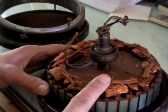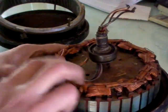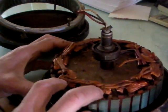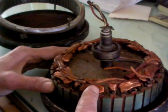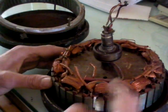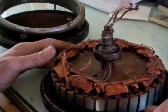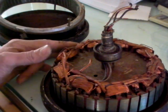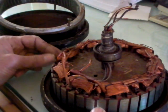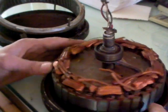The plan with this project — and I hope I can start and finish it, this is the first video — is to take all this off. It's currently a two-speed motor, not a generator. The coils are nicely wrapped, two-phase, two-speed. The plan is to rip all this coil out and recoil it with a serpentine winding idea. I'm only going to put about 20 winds per coil just to test it.